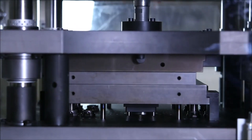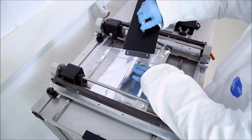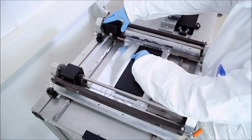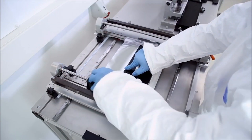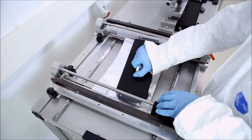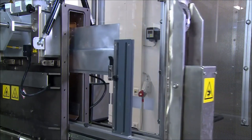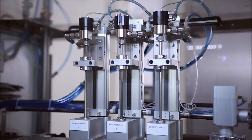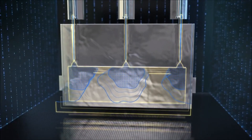In general, a certain external pressure is applied to lithium batteries in order to maintain good contact between the components during cycling, and this is especially true in the case of solid-state lithium batteries. For cells with a liquid component, this pressure will squeeze out the liquid — in this case the ionic liquid electrolyte — if it is solely placed between a solid-state electrolyte, in this case the LAGP, and the lithium metal anode.